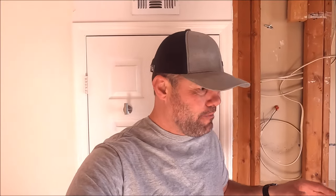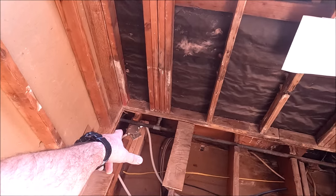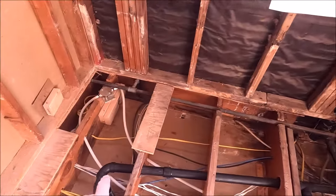It is Monday, we have a lot of work to do. We want everything ready for board and waterproof, but there are a few things to address first. We are installing sheeted mosaic for the bathroom floor — it'll flow into the shower as well, curbless — so we need our substrate to be extremely flat and level, meaning we need to pour self-leveler. Plumbing is done: bathtub mixing valves installed with a diverter, shower head raised, drains complete for both the tub and shower.